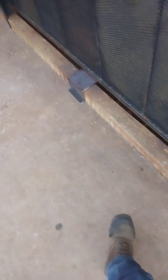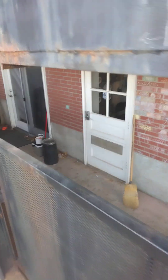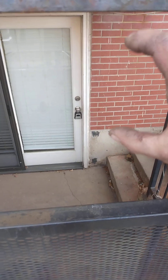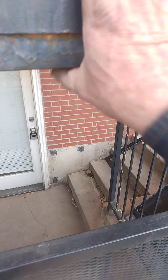So what I'm doing on my brackets is just kind of straddling the concrete - I don't want to blow the concrete out, it's pretty old. I'm gonna build some brackets and set them on top of the foundation lip here so they can't go anywhere. Off my new support columns I'll come up underneath here, coming down about four inches and running new five-inch C-channel all the way across. Then I'll put some kickers in on my new channel with a piece of angle here to re-support this.